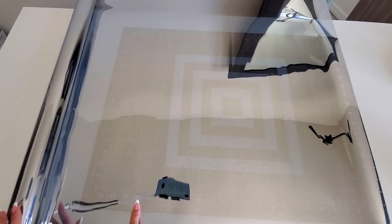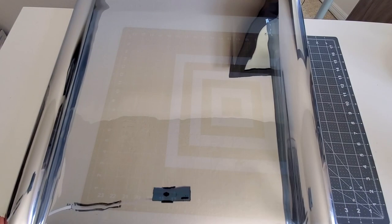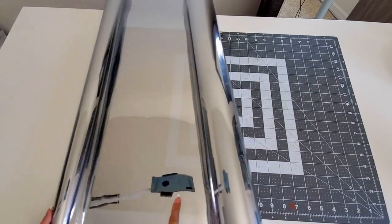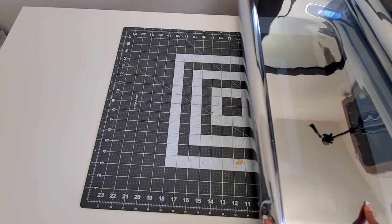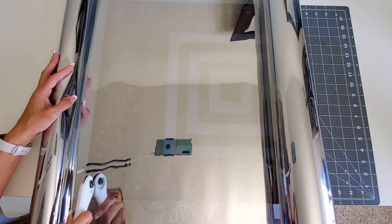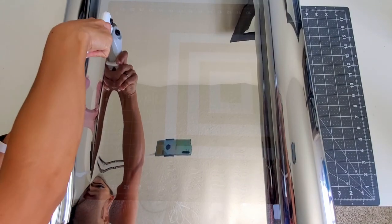One tip is when you apply your window film, make sure that the sun isn't directly on the window. My guess is because the heat will actually dry up your liquid a little too quickly. I decided to cut the width using my cutting mat. We want to cut the film about an inch larger than the entire perimeter. Make sure you roll your film to avoid creasing. On my first try, I immediately put a crease about three inches in and had to cut that part off and re-measure again.